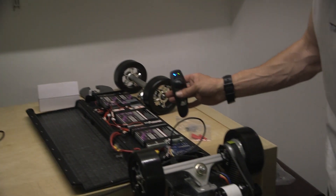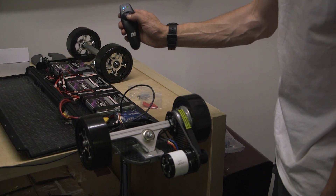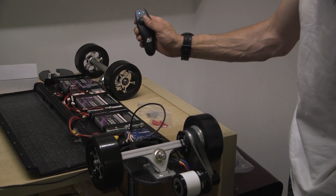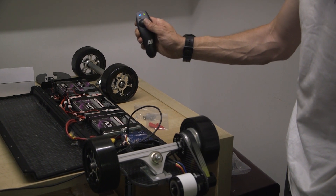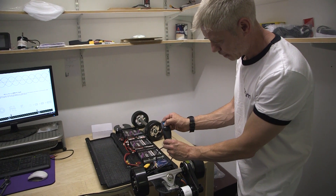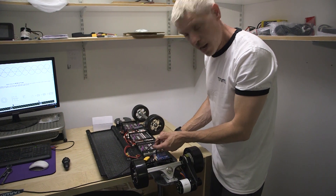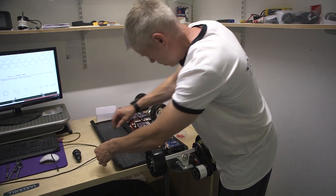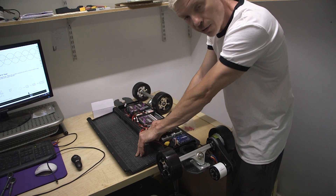At this point, the board should power up. Test brake and accelerate. You can crawl very slowly as well — you don't have to go at full speed, so this is quite a good controlled speed. Once this is done, turn off your controller and pull out the USB cable to the VESC. Your setup is now done. Pull the loop key and unpower the board for safety.